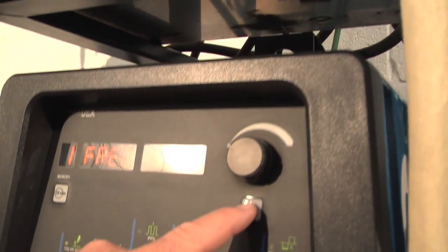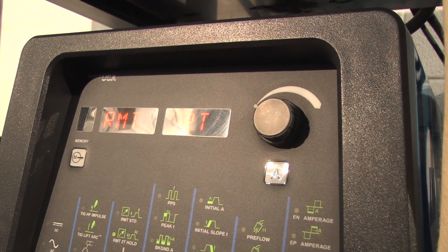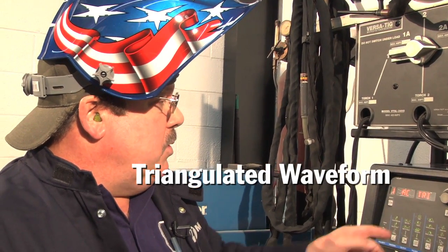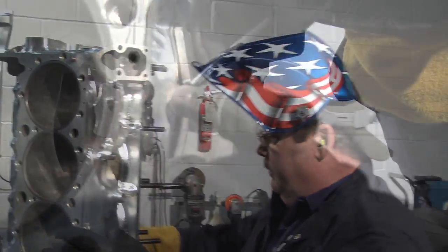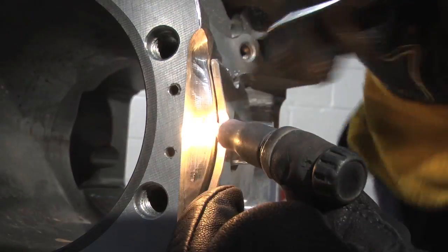The big advantage here is the waveform. We're going to switch over — advanced wave is too penetrating, too aggressive for that application. So we're going to use this new triangulated waveform, which is really good on thin materials. We'll see the Dynasty weld this 20 thousandths thick material to this 1/8" plate. With the triangulated option, thin materials are now extremely easy to weld.